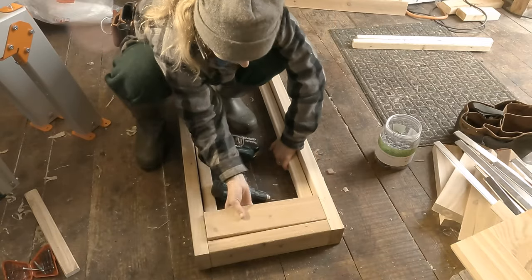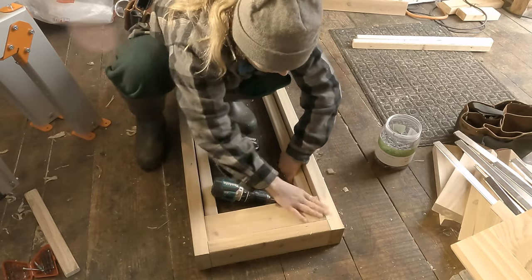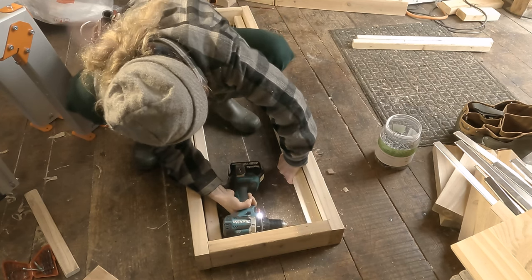The cedar benches are quite simple. The decking boards rest on 2x2 nailing cleats screwed to the frame. The directions call for 1x6 cedar boards, but I could only find 2x4s, and those work just the same.